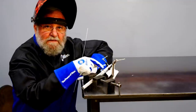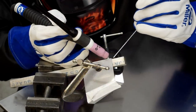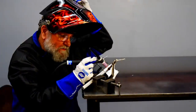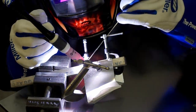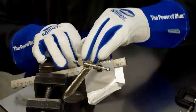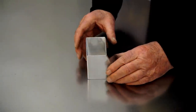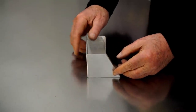The material is carefully aligned and clamped up tight against a square aluminum bar. I'm going to put a tack weld on the far end, then another tack near the center, and now I can weld the entire seam. So let's unclamp this and take a look — there's our finished weld. Here's our rotated and offset rectangular transition, and I think it actually came out pretty well, especially since we did the bending with a homemade tool.